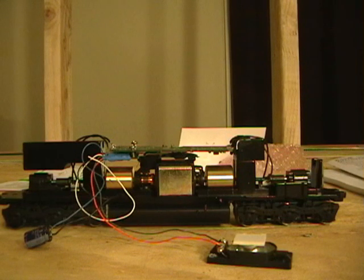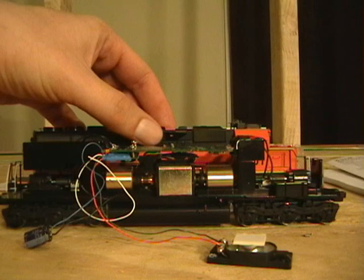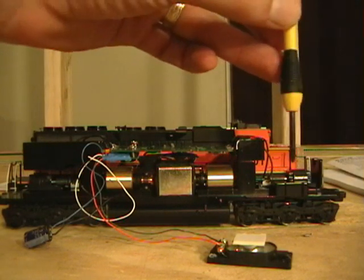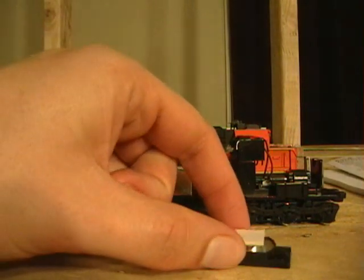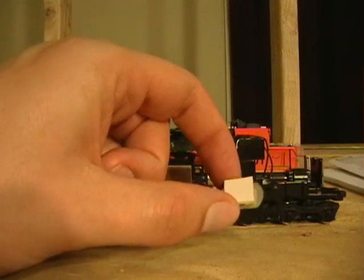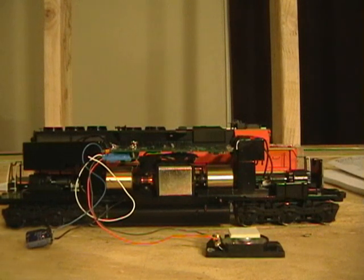The next thing to do is to seat the speaker as well as the capacitor. If I place this shell down right behind the locomotive, you will notice the only spot that really has any room to put a speaker is right up in here. I've already placed a piece of double-sided tape — actually carpet tape, it holds pretty well. In my other videos I used an enclosure and then placed the tape; that's okay too if you can make it fit in here. For right now I'm just going to install the speaker and we'll give it a test run after that.